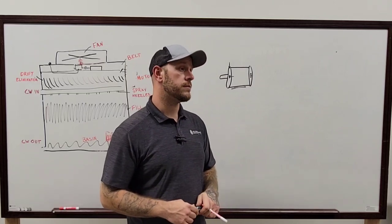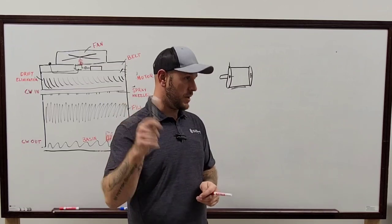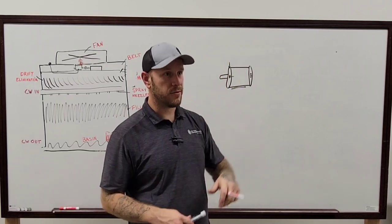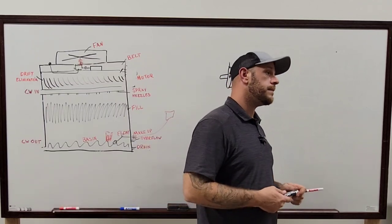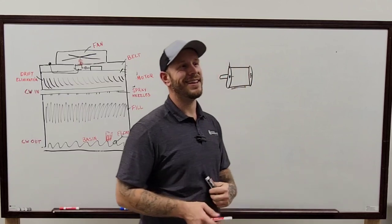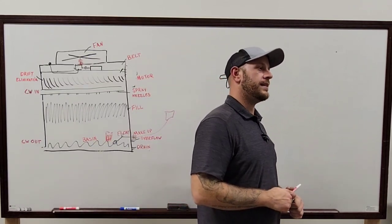Especially whenever you're going to test them, run it up to 100%. If you don't hear anything when it's ramping up, and you hit that off button on the VFD and everything gets really quiet and all you can hear is the mechanical stuff running, that's when you'll really be able to make out what sound you're hearing a lot of the time. If you can do it that way, safely, please. Don't be in the tower doing that. Bad, bad. What else?